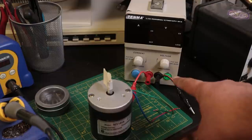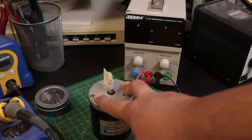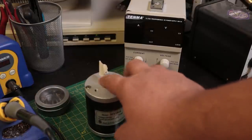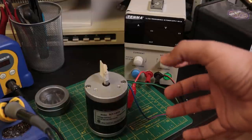All right, so quick math tells me that if I want this at 60 RPM, that's around a 35 to 1 reduction. So I need to gear this down. Well, how am I going to do that? So I've actually done the math, and it turns out that 1980 divided by 60 is 33. Now, that's kind of a wonky ratio to have in multiple stages, so I'm actually going to tweak that to 36 to 1, which will give me an RPM of 55, which I can totally live with.